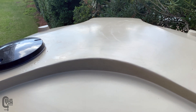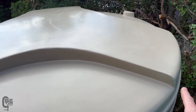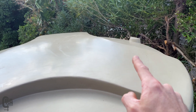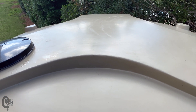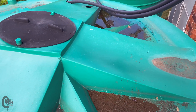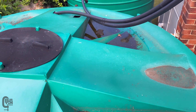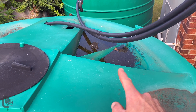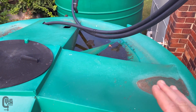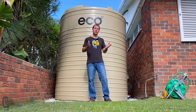Another feature I like about the eco tank design is the top of the tank — it has a rather large curve so water runs off really well, and it's also got three rather large curved ribs, so it's not likely to collapse over time. Comparing that to one of the other tank designs, this older tank is a good couple of years old and we can see the roof has taken a beating — not from people climbing on it, but just from general wear and tear. Every time it rains, water collects in multiple spots and it becomes a breeding ground for mosquitoes and larvae.